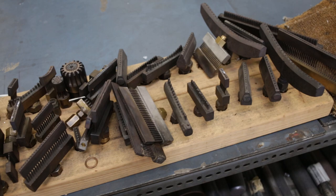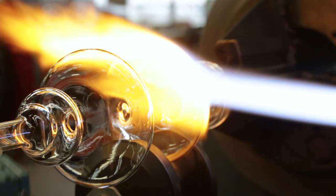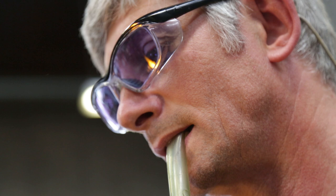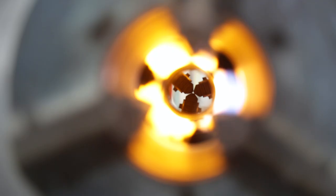The thing that's really challenging is to get the hole in between the two volumes of glass when the glass container is in a sort of liquid state. And the diameter of the hole has got to be very precise, so it can only let a certain number of those little balls through at one time, which is what controls the timekeeping aspect.